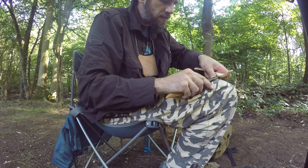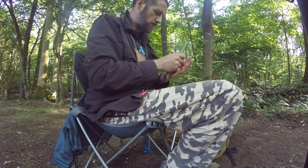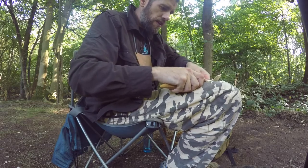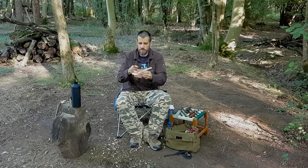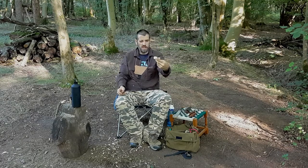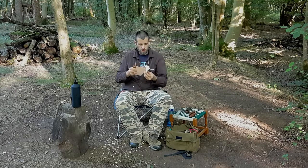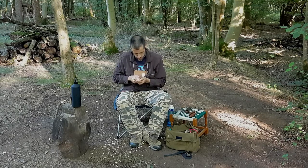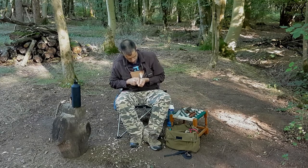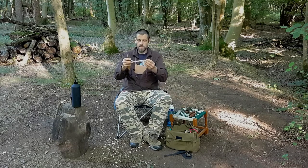One tiny little fluffy bit there, and that looks nice — that's pretty good. A tiny little bump this side just to iron out now. Right there. This is something that's going to be difficult to show on camera, but I've got a nice parallel curve there. Looking at it from the end, looking down the handle — it looks good. This side of the handle is a tiny, tiny bit high, so I'm going to come in, angle the knife slightly, and just take a shaving off of that side of the handle. That's nice.